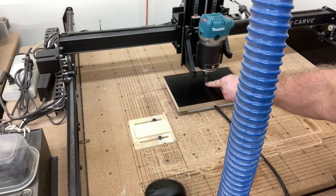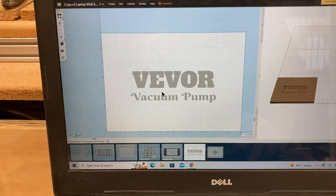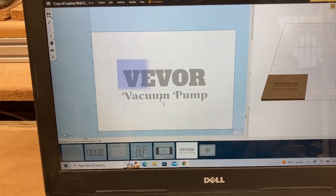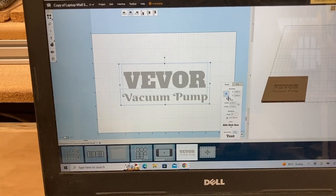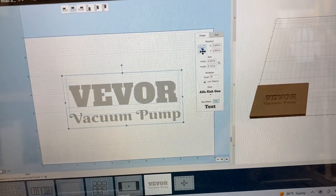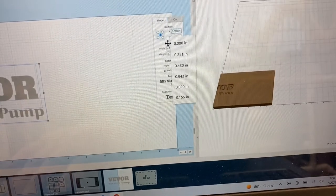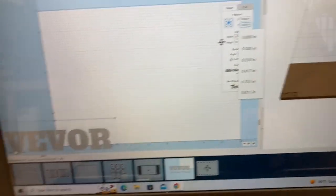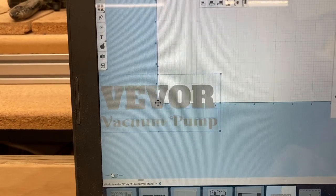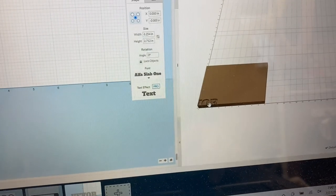We're going to use the center point as the beginning. XYZ home position is going to be right there in the center. It's important that I set this up the same exact way. Currently it's down at the bottom left-hand corner. All I need to do is highlight both of these, and you see this right here is in the center point. On the X, I'm going to move this to zero, and on the Y, I'm going to put that at zero also. It looks like it's off the board, but that's okay. The center point is right there, that matches the machine, and this will carve just fine. When you look at the preview, that's all you're going to see, and that's okay. If I hit simulate, you can see exactly what it's going to look like when I carve.